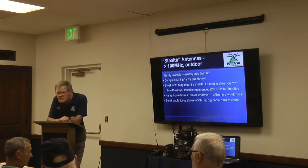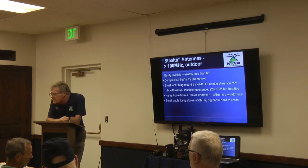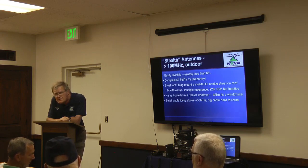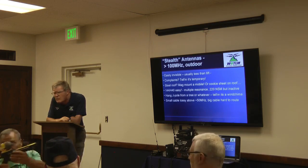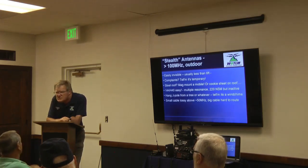And I was intrigued with the 50 megahertz channels for a while. Turns out there's not enough activity on them to be worth the effort. But so I ran 50 foot of hardline to that quad band antenna I've got on the roof. What size? 5/8 inch, something like that. And whether it bought me anything, I don't know, but I'm not taking the antenna down to change it.